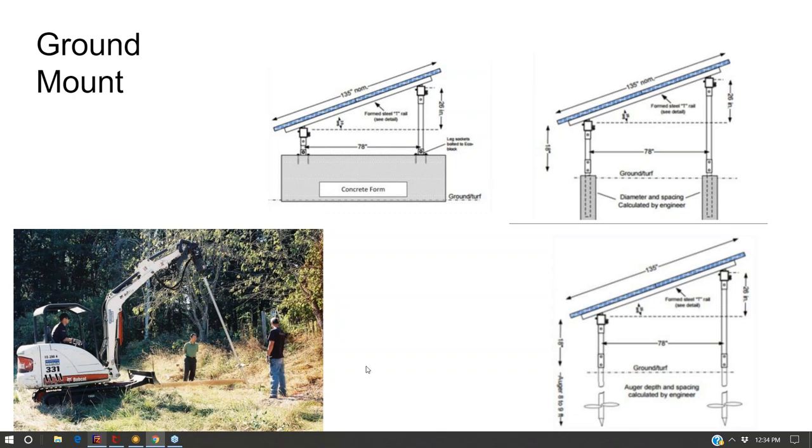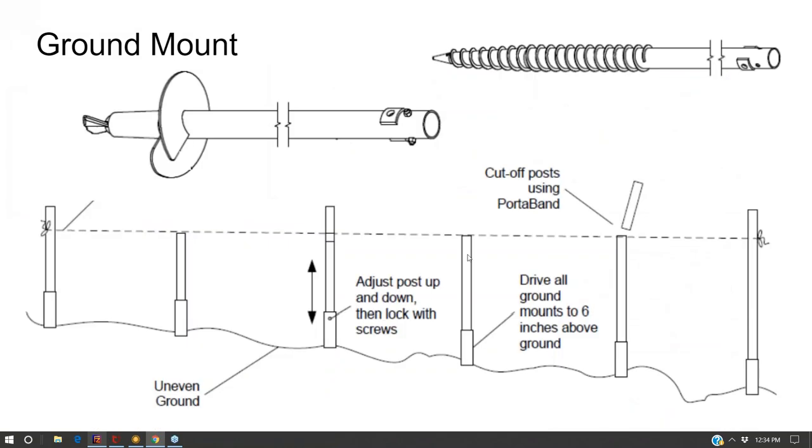You got to use an upgraded bobcat with a vertical reach and upgraded hydraulics to have enough power to twist the screws into place. We use a laser level to keep our piles relatively level. I guess you could cut them off, but that's a lot of cutting.